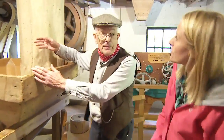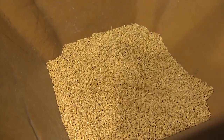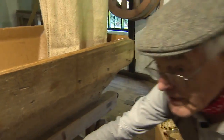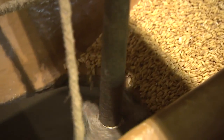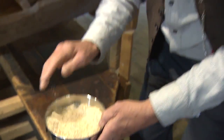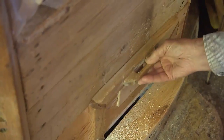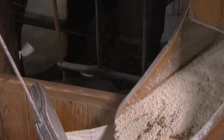Let's start at the top, because the oats come down this chute here and go into the hopper — so this is a hopper containing the oats. From there it goes down this sloping chute, and it drops into the middle of the millstone through the hole that's called the eye, and it comes out at the edge. If you look down here, you can see the oatmeal coming out round the edge — that's the actual oatmeal. Then it gets carried around by the action of the wheel to a chute at the back, and it goes down the chute to the flour sack in the basement.